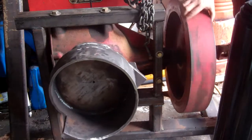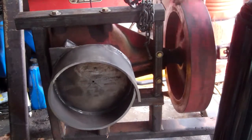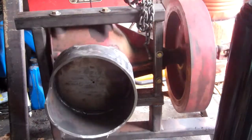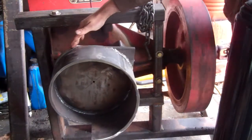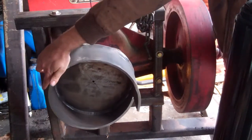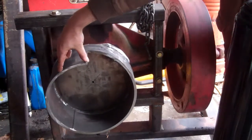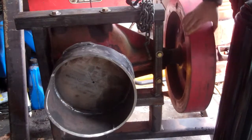The cutting wheel is already cut to shape. I have shortened this arm, which came on the gearbox — I shortened it and cleaned it up. This backing plate was originally square, and you can see the high spots where I've ground it down just a little bit to make it closer to the profile here. This cut edge is flat right up to here, and then I've sharpened it for the last half rotation, pretty much until it gets to completely closed, and then it's flat again. I've got about a three-inch bar of flat stock there just to make sure that it's completely cut off, and it leaves me some options to do what I need to do.